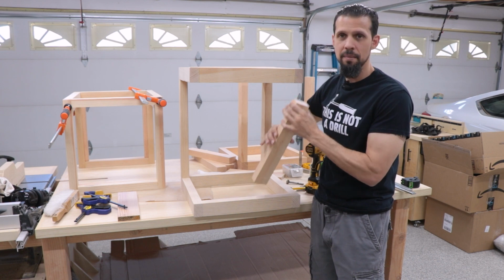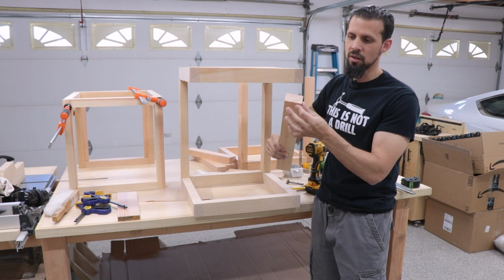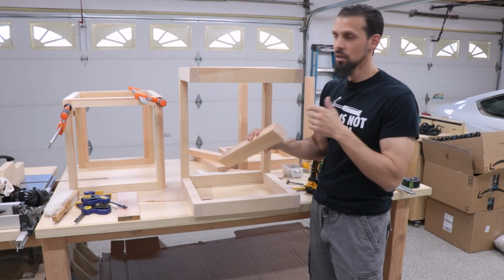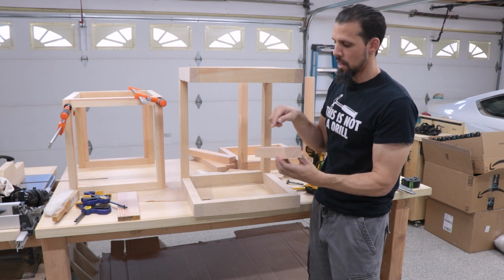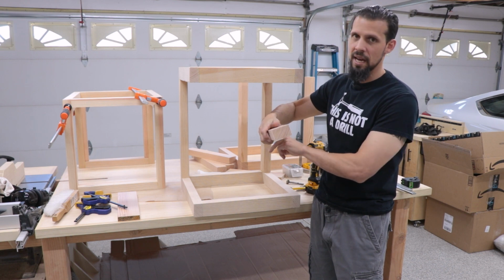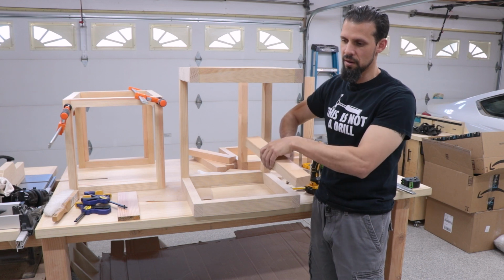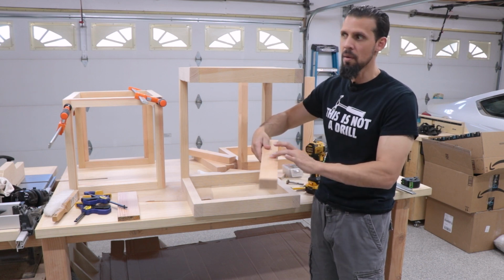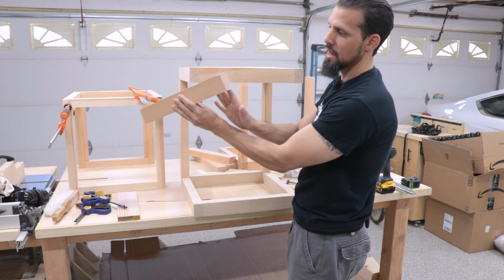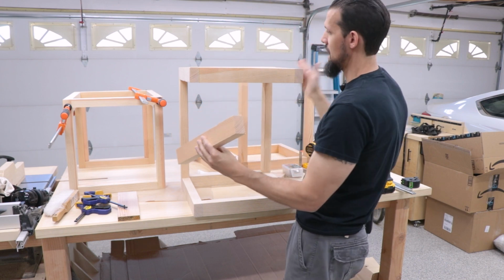So definitely keep that in mind if you're making these and you're not making sure that all four pieces are all 90 degrees with each other. So what I ended up doing to rectify that with the new ones that I'm making over here is I made sure I had this labeled, so when I was shaving down these sides with my table saw, I made sure to keep this side up on both sides, so when I flip it around to do the other side, I have that marked. So when it's going with this one, I know I got this 90-degree surface to here, to here, to here. This fourth side doesn't really matter because it's going to be the outside anyway.